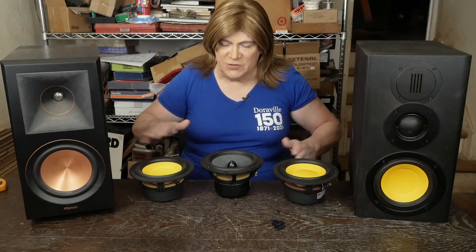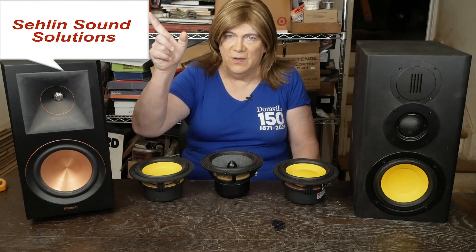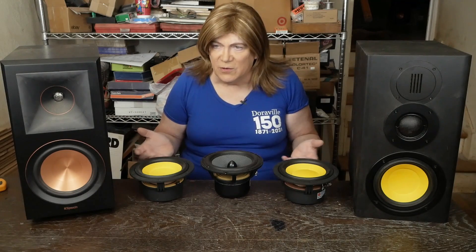So we have these drivers here, and I told you when I got done with it I experimented with the out-of-the-box crossover, then I did the one that's popular on the internet — I'll link it in the description. That definitely improved it; the top end was a little too bright, but it still didn't have the bass punch that my RP600M has or the two-way speakers have. I'm scratching my head: is this a crossover issue or a speaker driver issue?